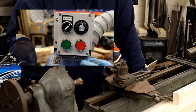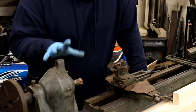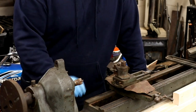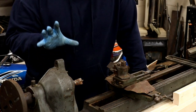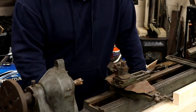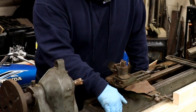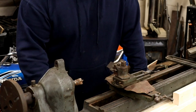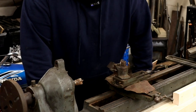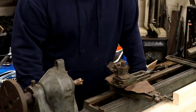The plan for restoration is to spend the next few hours breaking this completely down, removing all the bearings and everything bolted on. Although the bearings are fine, I don't like doing jobs twice — I've been quoted £180 for the bearing sets, so I'll replace them. Everything is going to be shot blasted, so I need to make bungs to protect the bearing housings. The spindle will be checked with a micrometer. I'll return with hopefully some larger spindle work made.